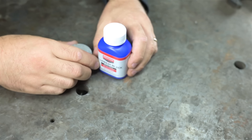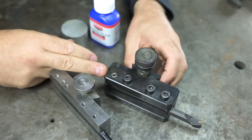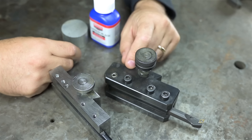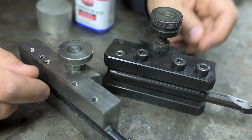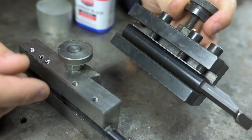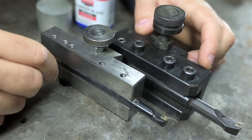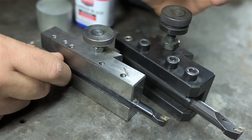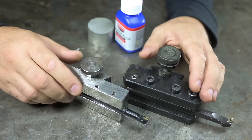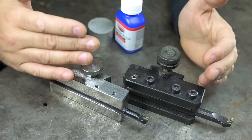Quick refresher if this is coming out of the blue. Here is a metal part with no finish — this is as machined. Here is the same part, or similar part, that's been cold blued. Cold blue is an easy-peasy room temperature process that, despite its name, turns metal parts black. Why would one want to turn their parts black? Well, they look better — dare I say, more professional. And I think the cold blue finish helps keep the parts from rusting, or slows the rusting down anyway. Though I have blued parts that have rusted. If I may speak chemically, the cold blue stuff is selenium dioxide — most well-adjusted people just call it cold blue. And it only works with steel.